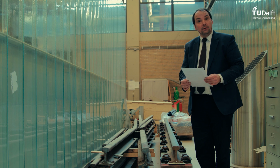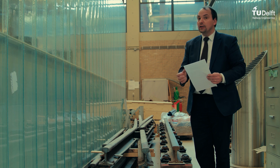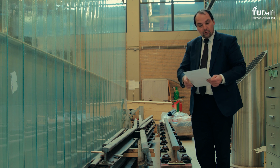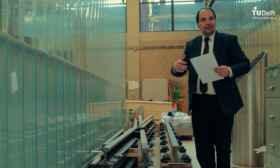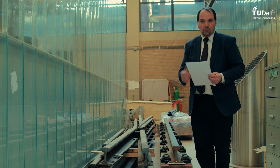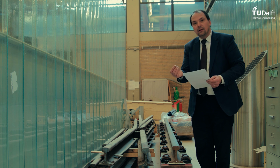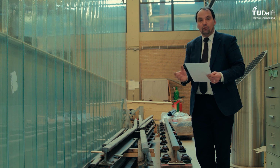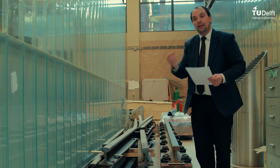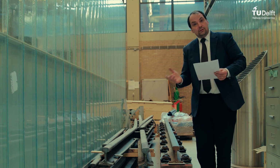Another question I got this session was about defects and the heat affected zone. I think it's really interesting to understand more about this phenomenon of getting defects in your rail. So you need welds. You cannot get rid of welds because we cannot make one big long rail, so you have to use welds. And therefore you put heat inside the rail, and therefore you get a softer section on the rail, and that's the heat affected zone, and that implies that you get more problems with defects. But the question is, what is this heat affected zone?